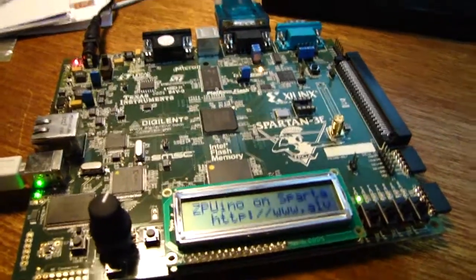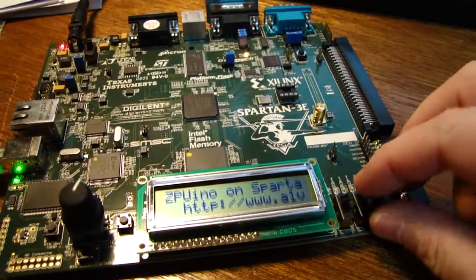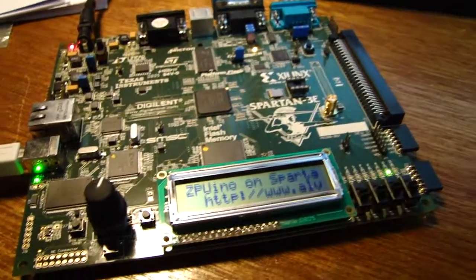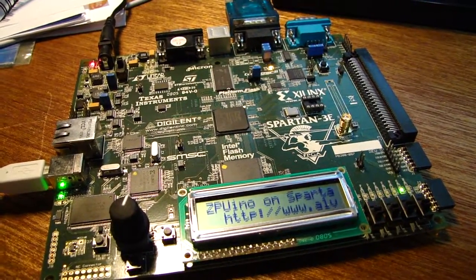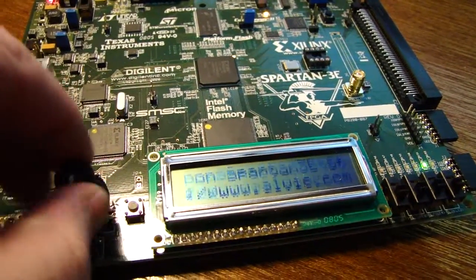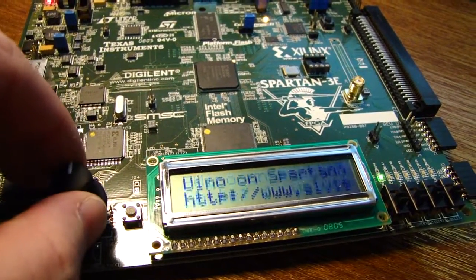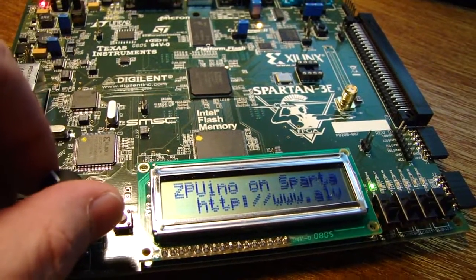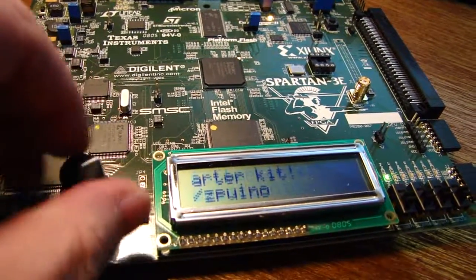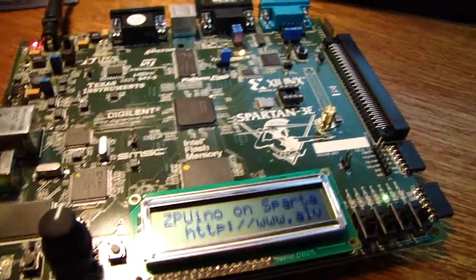But for what I need for my little project, I need something that can just control a wishbone bus to push data backwards and forwards, or at least monitor it and provide some sort of user interface. I didn't really want to go digging through making my own CPU or setting up something large and complex like one of the OpenRISC cores. I just saw this one came with the GCC compiler and thought if I can get the Arduino thing going fairly easily, it's probably a really good candidate.